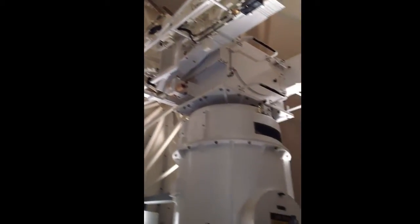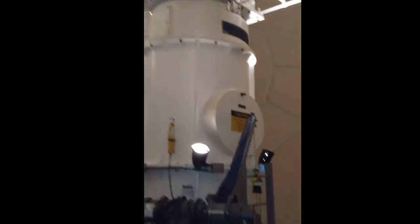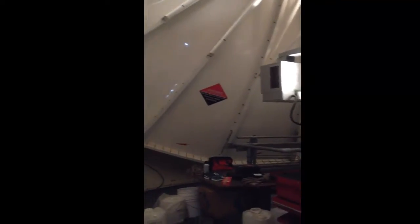This pedestal weighs 21,500 pounds. The dish is a 29-foot dish in diameter, goes all the way practically up to the top and winds back around. We have a series of counterweights on the dish. The maximum revolutions we can have on this dish is six revolutions per minute, and the dish itself weighs 2,100 pounds. But with the counterbalance on the back of the pedestal, if you were to grab the dish and just lift it up, it would lift up very easily because of the counterweights.